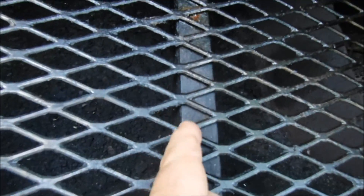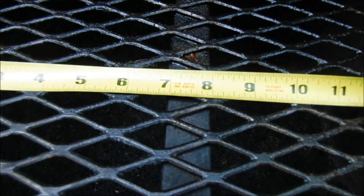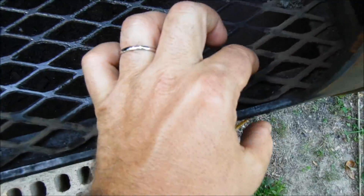Let's start out with the grill. The grill is so wide that if you put this expanded metal in here, a lot of times it'll bow — unless you have some type of angle iron, not flat bar, but angle iron. That is one inch angle iron. So what I did was I went to a steel supply store in Beaumont, Texas, and I bought some one inch angle iron — I think it's one inch by one eighth or something like that. I cut a piece, then used C-clamps and clamped it to the inside of the vessel, going all the way down.